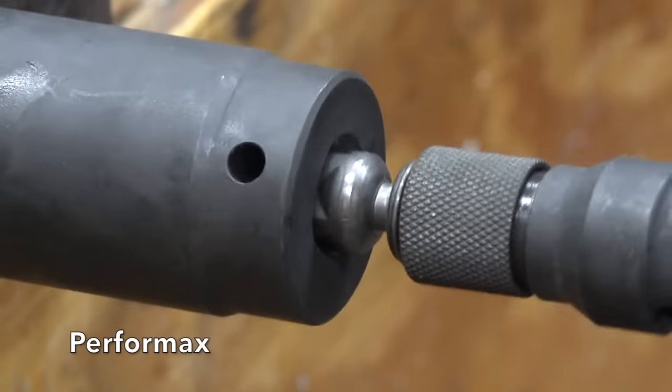The Irwin didn't twist much before breaking, while the Irwin tested in the first round did twist quite a bit. The long narrow shaft of the Bauer was really absorbing the impact, taking a long time to build pressure — it finally broke at 1,225 psi, which is above average. The ARES broke at only 675 psi, below average, and like the Irwin, did not twist before breaking. The Makita did a decent job at 1,050 psi, with the shock-absorbent zone again being the failure point. The Hercules outperformed the Bauer at 1,300 psi compared to 1,225 for the Bauer.